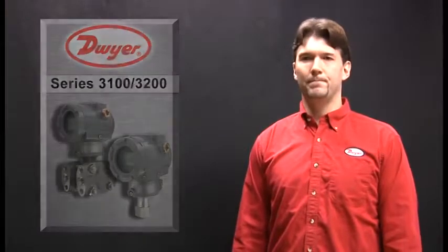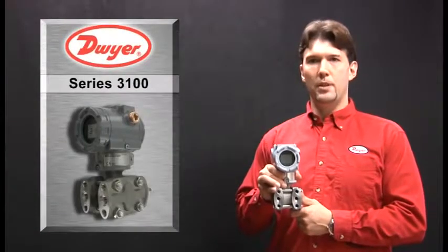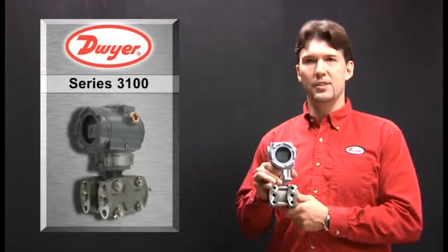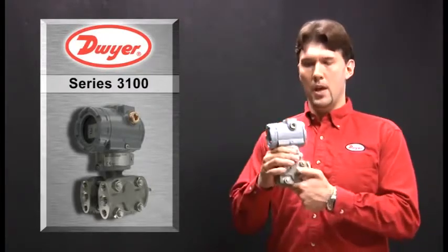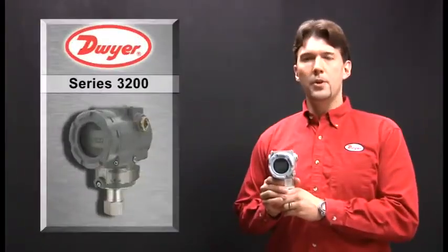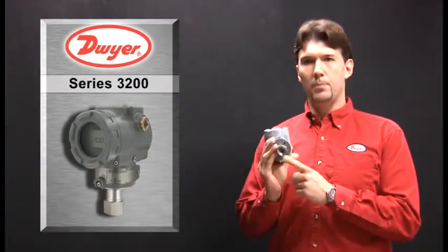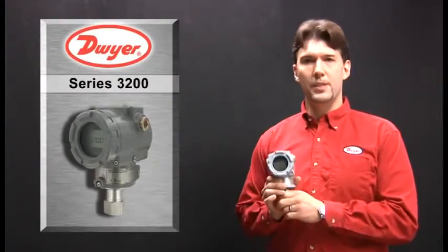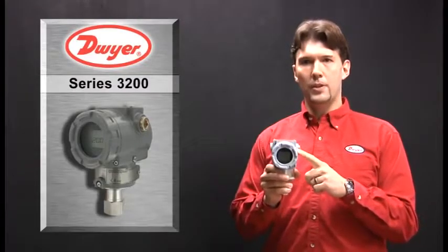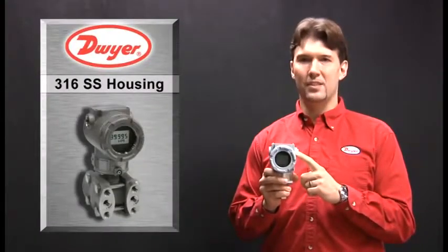So let's get started. The 3100D is a differential pressure transmitter that utilizes an oil-filled capacitance sensor with all 316 stainless steel wetted material, and also comes standard with 2 drain valves. The 3200G is a single pressure transmitter that utilizes an oil-filled piezo sensor with all 316 stainless steel wetted materials. The standard enclosure is a powder-coated die-cast aluminum, but we can also offer the housing in 316 stainless steel.